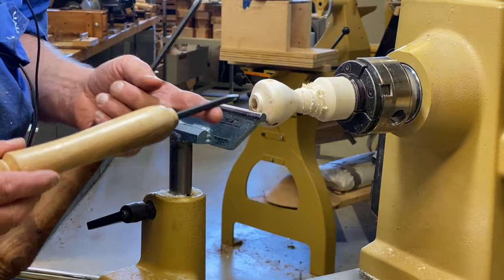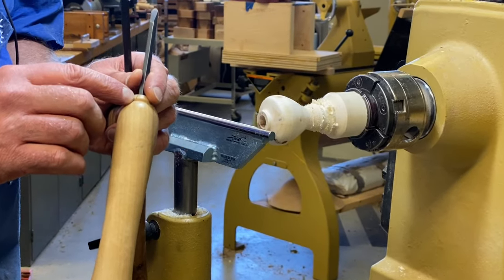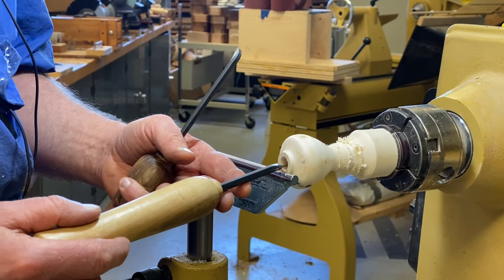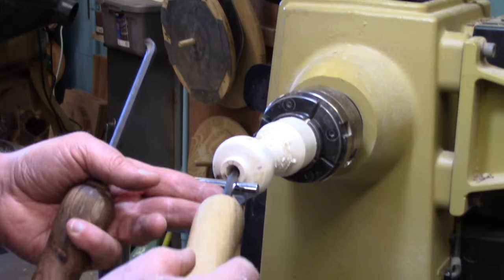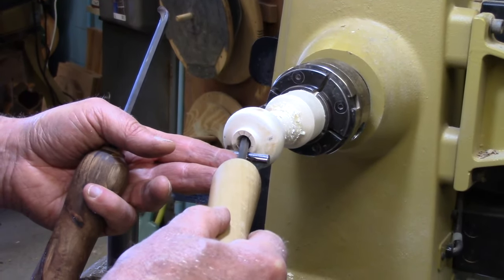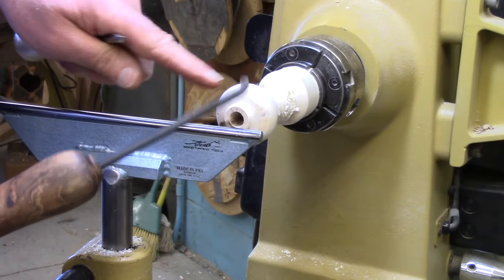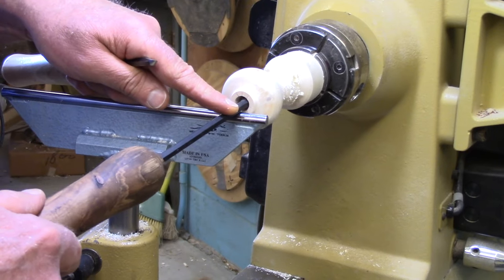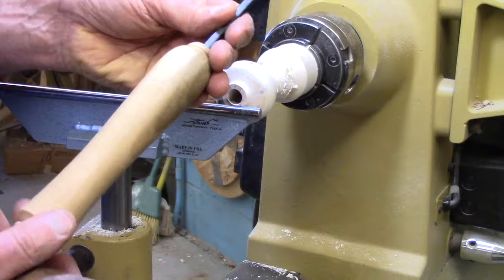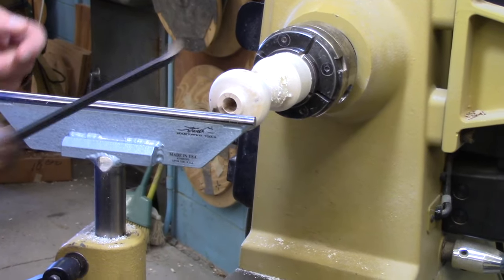You do have the option, depending on how much room you have, to start off, and you can see my little pencil mark right here indicating where the blade is totally horizontal. So you could enter with it slightly angled down, go in, open the face, and do some cuts. Depending on the size of the hole, you might not be able to have this corner, this hook, enter in a balanced way, in a secure way, and so you may have to start off with a straight spindle tool. Okay, so I'm gonna do a sample cut